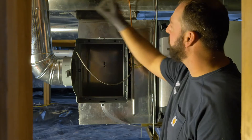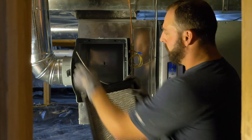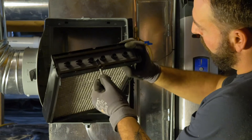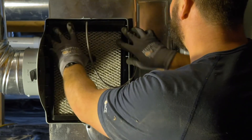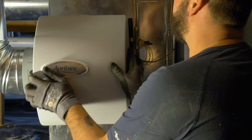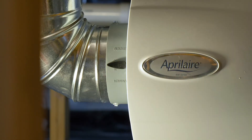We've got our ductwork done, our water lines in and out, and our electrical. Now all we've got to do is put the unit back together. We're going to put the water line through the hole until it hits the stopper — that's how you know you've got it in the right direction. We'll pop that together, put the cover on, and then we're ready to test the unit. Just make sure that you switch it from summer to winter, and we're ready to go.